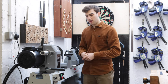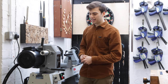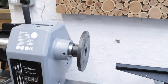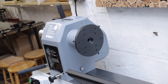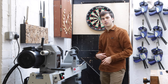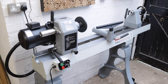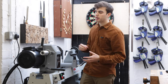So that is the lathe set up - I love it, I think it looks awesome. It's a lot beefier and bigger than my last lathe. Now I'm going to show you all the features so you can work out if it is the lathe for you. The max diameter you can turn above the lathe bed is 406 millimeters, but the headstock does turn so you can turn much larger platters outside the lathe bed, or move the headstock to the end and drop the extension bed down onto the cast iron leg to turn larger bowls. The distance between centers excluding the extension bed is 710 millimeters, and the extension bed adds another approximately 300 millimeters, so you can turn meter-long components on this lathe.